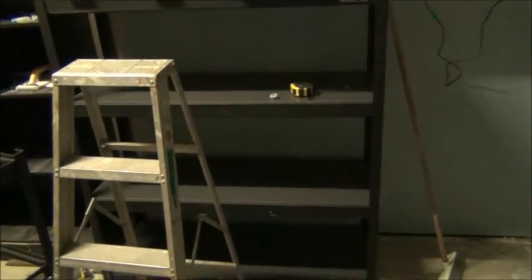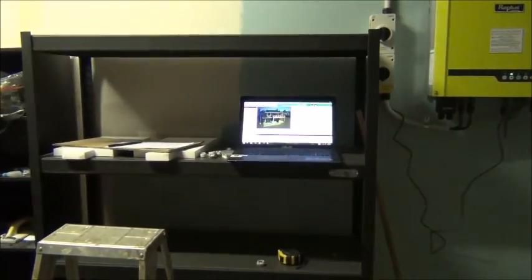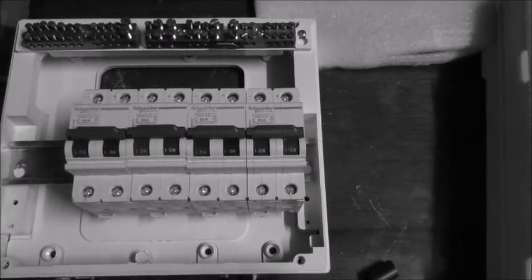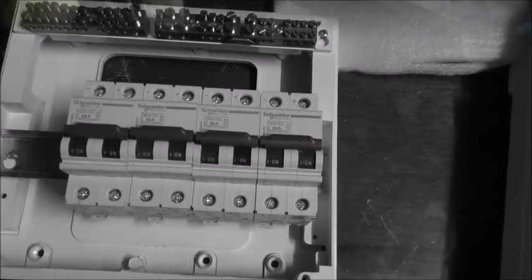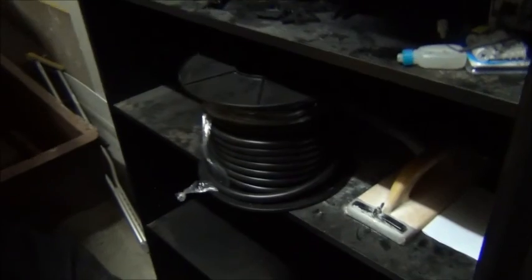This is my battery cupboard, or will be. One, two, three, four shelves. It will be fully sealed, with a bench below and breakers for the batteries — polarized 63-amp breakers per bank. There'll be one breaker and my cabling. This won't be happening until I get my service inspected, but it's all ready to go.